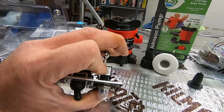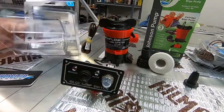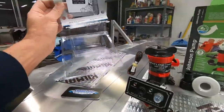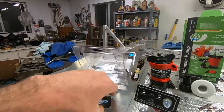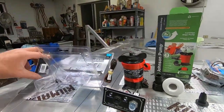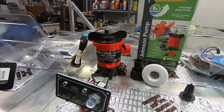This says 10 amp on the sticker, so it's only double the amps of the pump. The locked rotor on these pumps isn't much, so if it locks up or burns out and shorts, it might cause a trip.